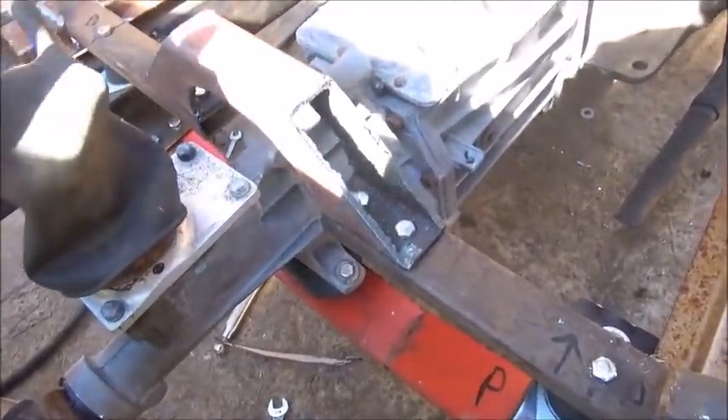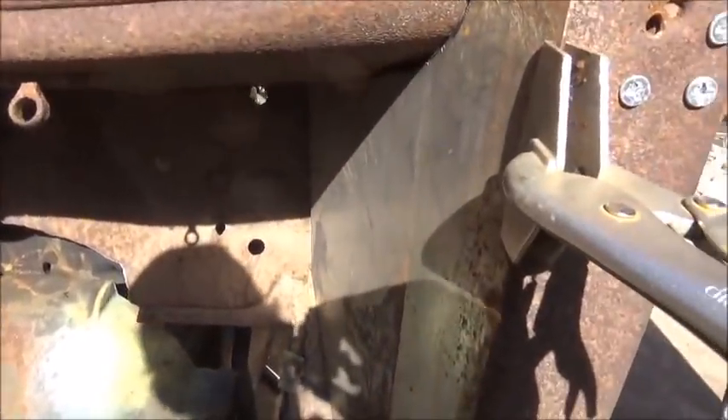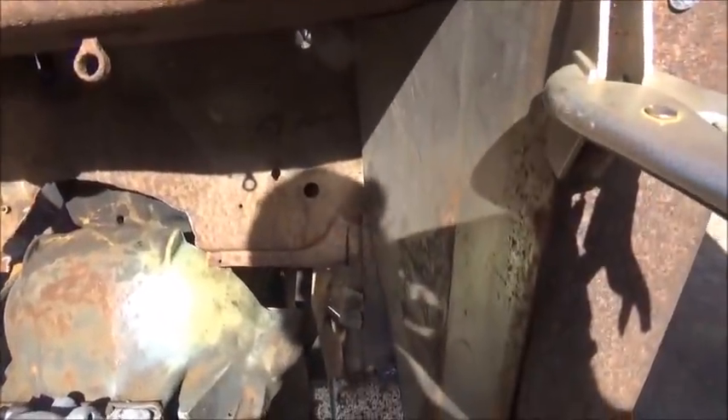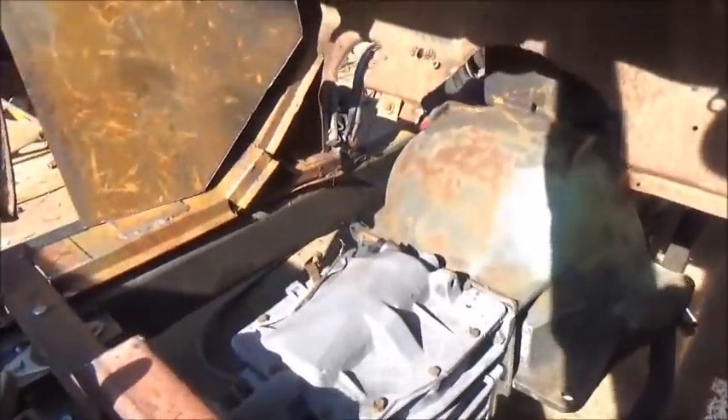I made some patterns and I'm working on the steel inside of here. This is going to support us so we can actually start doing door adjustment without the cowl flexing or anything moving. I've got the other one just sitting in there - just trying to fit them first. Then I'll come back and paint inside there with Loctite rust inhibitor - it changes to black. I'll get these welded in and hopefully start trying to adjust the doors and get them lined up so they open and close decent. Right now the cowl is just flexing so much.